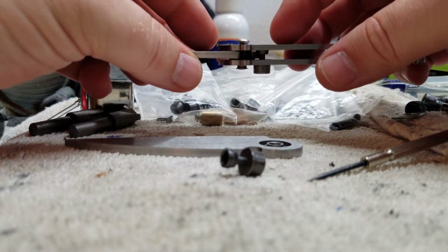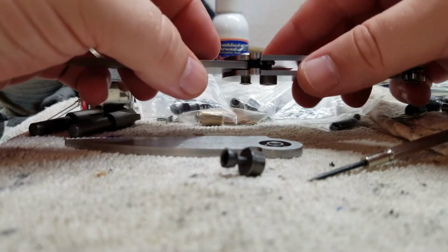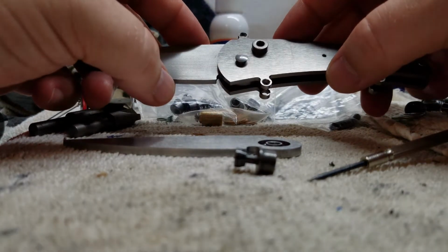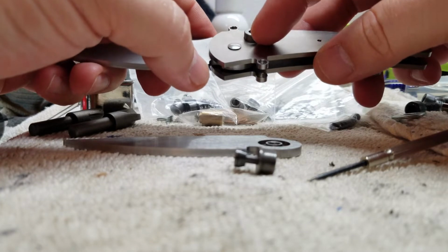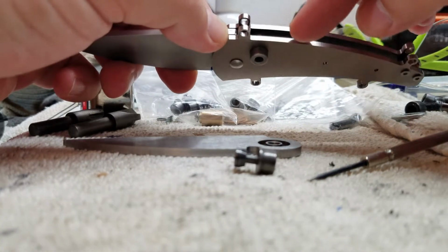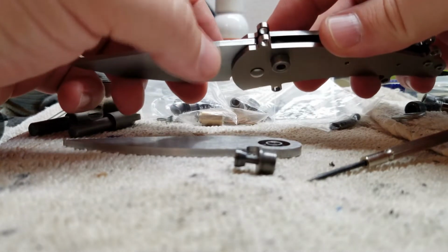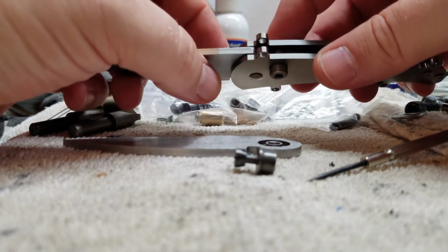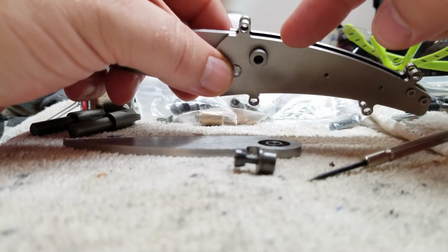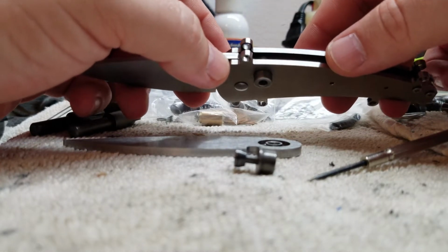And the problem that poses is that the counterbore that I used for these buttons is actually bigger than what I want. I ordered from a different supplier. They're pretty much the same button. I haven't actually found any buttons that I can buy that are a smaller profile, and these are much larger than what I want. But the problem is the button actually can't travel down far enough, because the counterbore that I had to make based on where I located everything would have to be 92.5 thousandths deep. But this frame piece is only 90 thousandths thick, so I can't cut a counterbore that is literally deeper than my piece, because that's called a through hole.